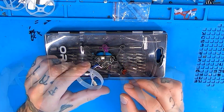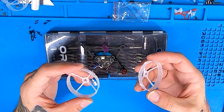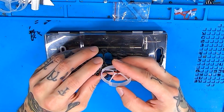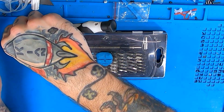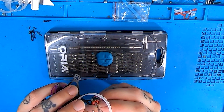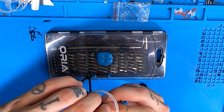I like to organize my ducts so they come off the whoop frame and go back on in a similar fashion. You don't have to keep them exactly where they were, but you want to keep the little side that's lower facing towards the middles. Turn to the side, get our duct on, get it lined up, and what I like to do is get one motor screw from your Fractal bag, run it through the carbon, through the duct, all the way up, and hold it still. Now I know my duct is lined up on the right motor hole with that lower piece in the middle.